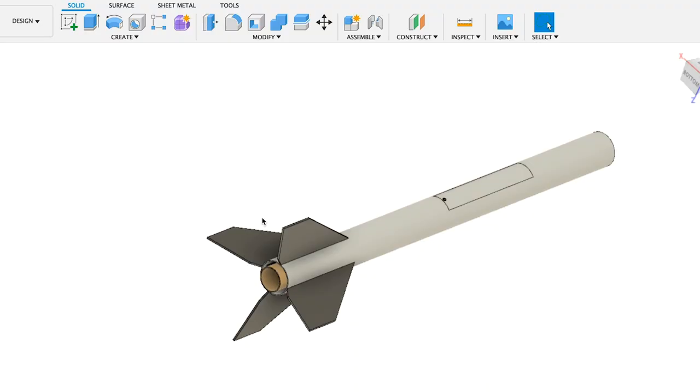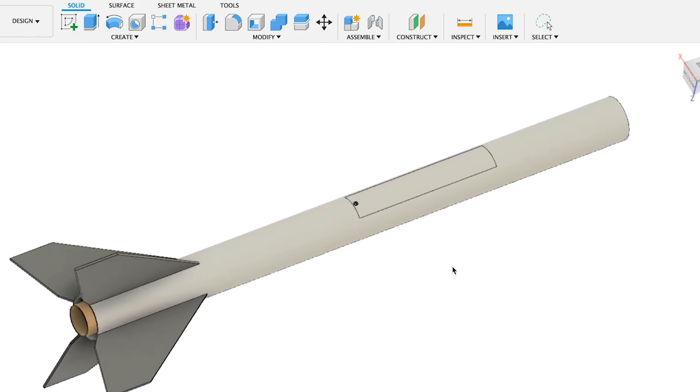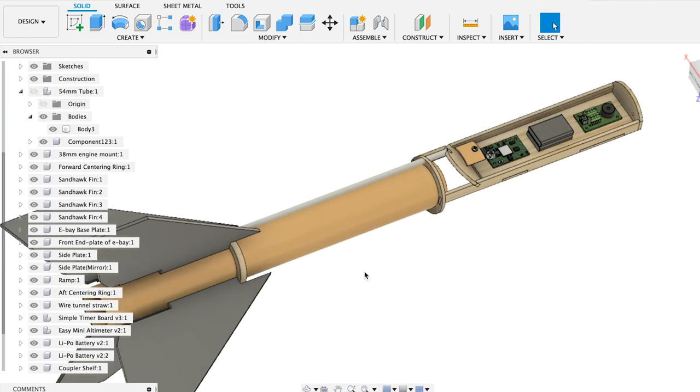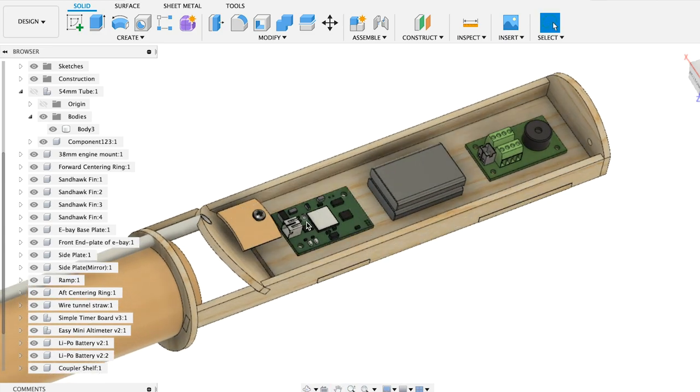Because this is such a complex project, I've gone ahead and put this into CAD software so I could design everything and make sure everything fits. Right now I'm showing the bottom part of the rocket. You can see the fins and the engine mount tube, and over here there's a cutout — that's where I'm going to put the electronics. Let me make the body tube clear so you can see what's going on. You can see the electronics bay inside the rocket. This component right here is the timer, then I've got two batteries, and then the Altus Metrum Easy Mini dual deployment altimeter. There's a little extra room in case I want to go with a different altimeter.